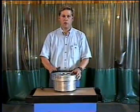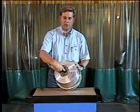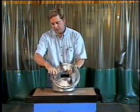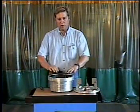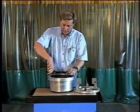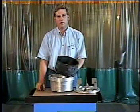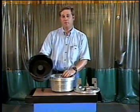To compare the difference in the bowls, let's take a look at one of our competitor's bowls. As you can see from the outside, it looks pretty much the same. If I flip it over, you'll notice the bolt-in nave with the straight shaft fit. The lid has four screws for removal, much like ours, but you'll notice the four impellers — and they're notched out here, which further reduces separating efficiency. One of the other things is their machines include a rubber liner. When this rubber liner gets full of solids, it sticks in there pretty hard. In order to pull it out, there is no tool — you pretty much have to stick a screwdriver in here and start prying to get it out. If your screwdriver punches a hole in the side of this liner, instead of spending $20 for an ABS liner, you're going to spend probably at least $125, maybe a lot more.